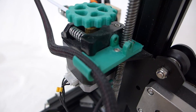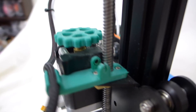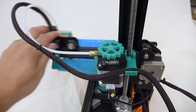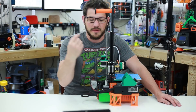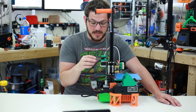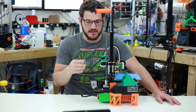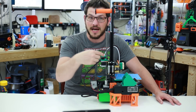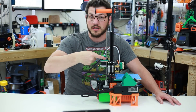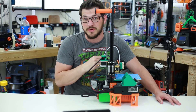Then we have this little cable and filament guide. On the filament guide, don't use the 3mm one — use the 4mm one and put a piece of PTFE tubing in there. I've actually worn through mine using the 3mm. It is great for holding your cable still and keeping it rigid so it's not flopping around or getting caught on anything. It also adds a guide so your filament comes down from the spool in a nice, solid path.